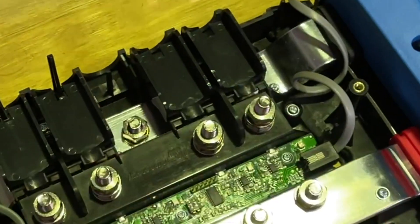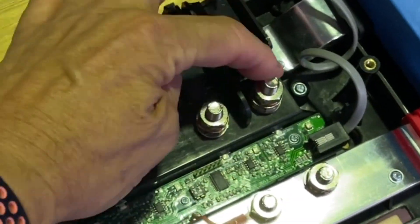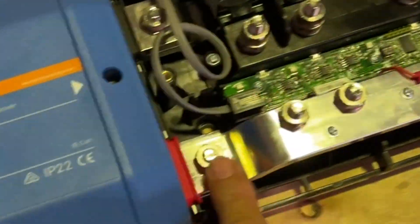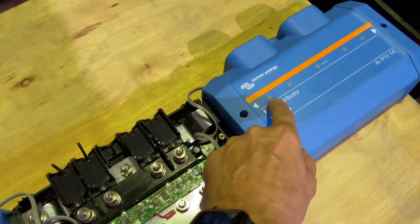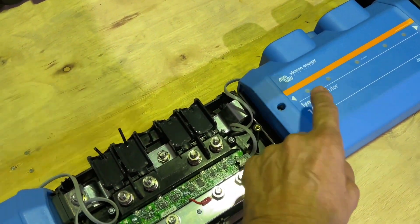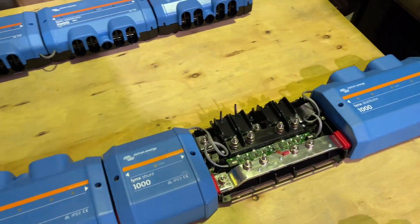Let's have a little look inside. The cabling comes in — the negative goes onto the bottom, positive to the top, mega fuse here, and a thousand-amp bus, just beautifully made. The little LEDs come on in the event that a fuse blows, and it shows you both here and also on the helm station.